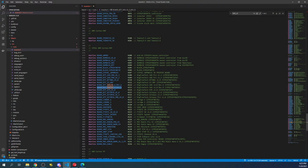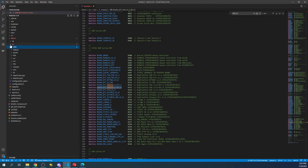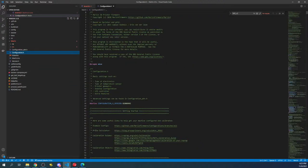You're also gonna note what the actual chipset is, because it says STM32F407. Now they may be swapping chipsets soon, so it might say 429 instead of 407. At the moment, the way that I would do it is to set it up the same way I'm doing it now. And then if there is a change, they're gonna have to manipulate their INI file. But I'll show you that in a second.